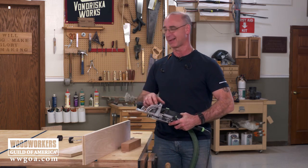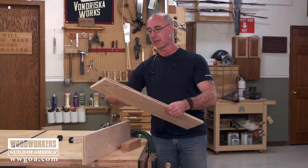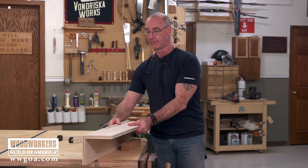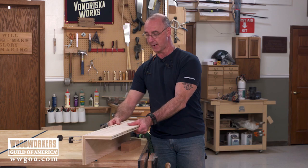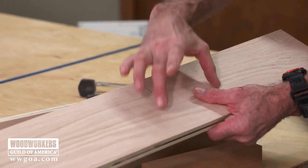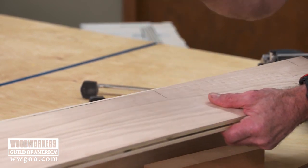There are areas where this can get a little bit problematic. In this case, these two pieces of plywood are going to go together like this to create an L, and this is a great application for a loose tenon, biscuit, domino, or dowel — it'll add strength, it'll register the surfaces. This one's easy, because there's a big surface here and we can set the fence on there and register it.